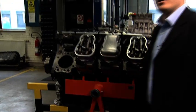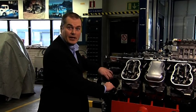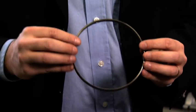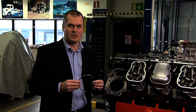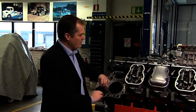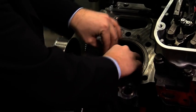In order to have a long and trouble-free service life, we have added a saver ring to the cylinder liner. This saver ring will scrape off the carbon deposits from the top land of the piston. An engine with this saver ring will have a longer service life and lower oil consumption.